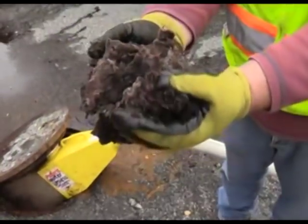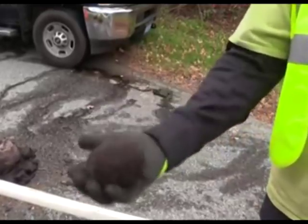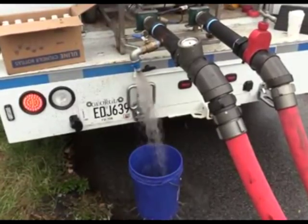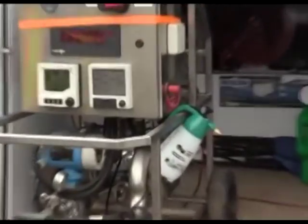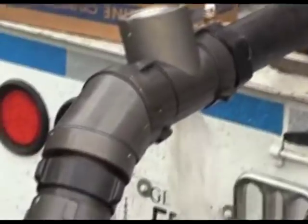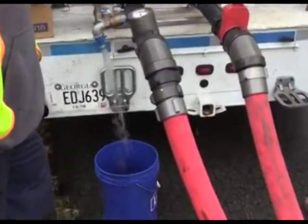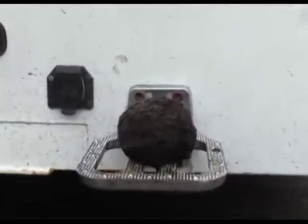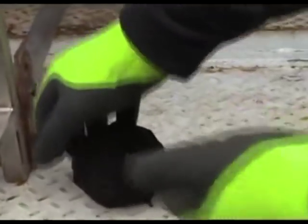So again, more of the ice. It's still pretty warm out — there was not a snowball fight. Now after the ice pig passes, you can see the improvement in the water quality that comes out. We can tell we are removing all the ice from the system because the temperature goes back up to normal. As the temperature approaches freezing, we know the ice pig is there, and after the ice pig is all removed, we know everything is completely out of the system and we can start to open it up again.